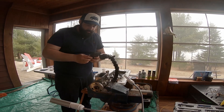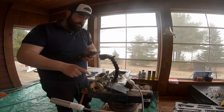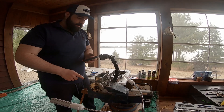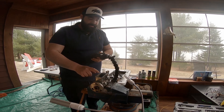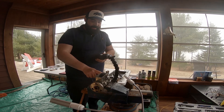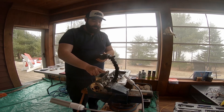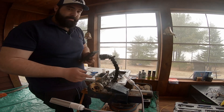The next thing I have to do is take off this governor spring. To do that, I have to take this pin out here, but first I have to take this inlet out. So let it tear down — you can go back on your stand.